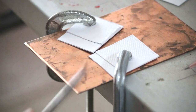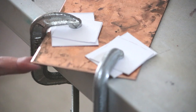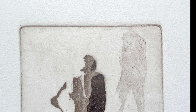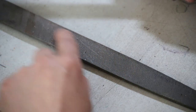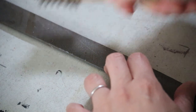Do the same thing on all four sides. Some people like to take the time to actually round the corner — just take your file and round that edge. I don't usually do this, but some people like it. When you're beveling, you might see little bits of copper get stuck in your file. Take a wire brush and you'll be able to get rid of it.